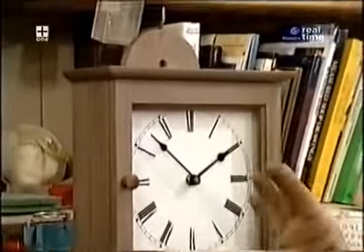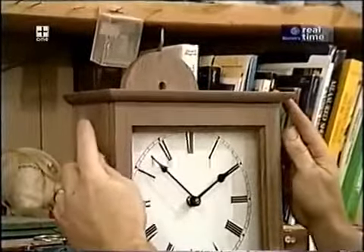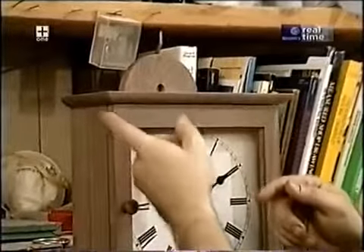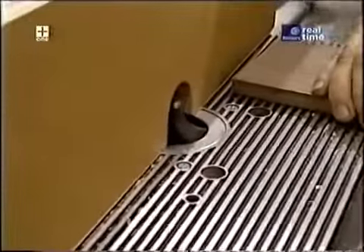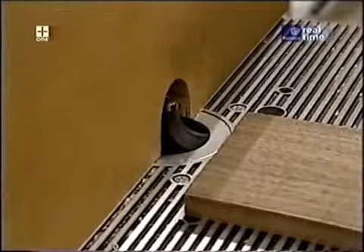There are two more pieces on the clock case — one at the bottom and one at the top. They're identical in overall size, and they hang out over the sides of the cabinet about five-eighths of an inch and also out in front of the door. The shape is not really a quarter round — more of a flare. To make that flare I'm going to use my router table, set up with a three-quarter inch radius bit, and I'll pass the blanks through ends first, then the front edge.